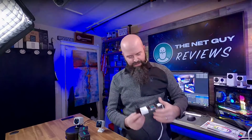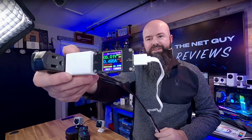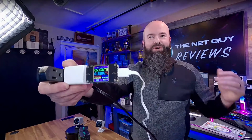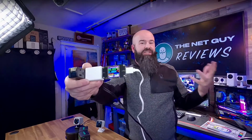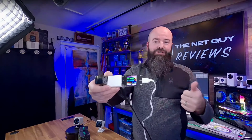840 nanometers, the product manager from Wyze said. I heard that earlier on the show. But what we can see here is now, if I bring this up, we're using 500 milliamps at 5 volts, so it's kind of boosted that up. That's 2.5 watts. That is so low. You have to remember, this thing's got a Wi-Fi 6 antenna in it, so it's transmitting data. It's got 2.5K pixel resolution, so it's got a bigger sensor, more pixels to calculate. It's got a faster CPU than they've ever had before, larger memory, larger storage. It's recording constantly, so it's doing all of that in 2.5 watts. I think turning on the inverter in my boat uses 20 watts, so it's like having at least 6 or 7 of these running all the time.